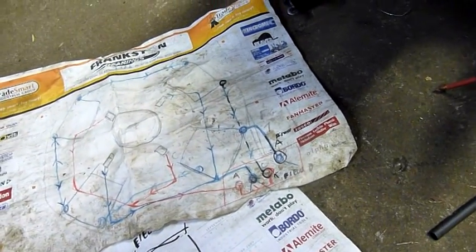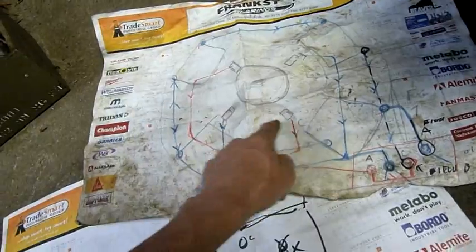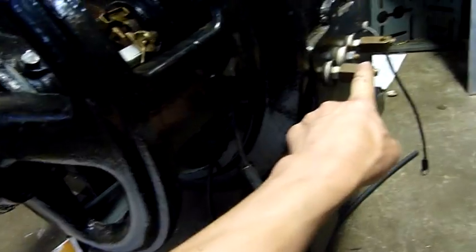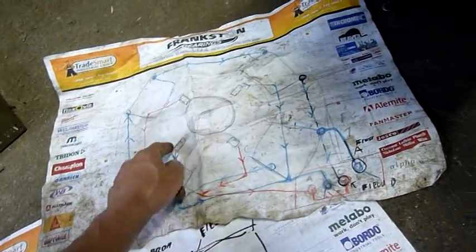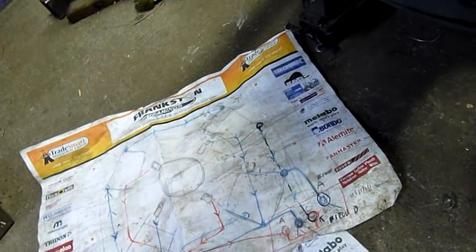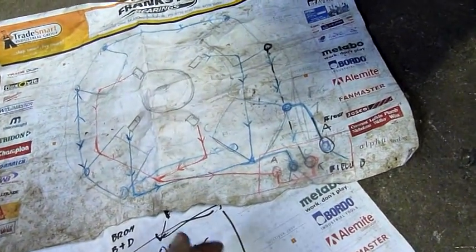I can always change things around after the fact. I'm just working through it. Brushes A and C are the red lines, and they were connected through to terminal A, and also bridged across to C. And then you had terminal B going up to brushes B and D. So it was a bit odd — it's almost like a two-phase. I don't think you can phase DC, but it's really unusual how they had it hooked up.